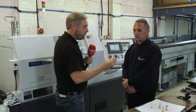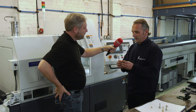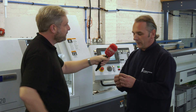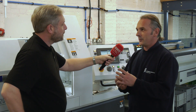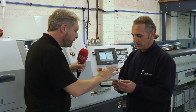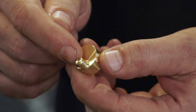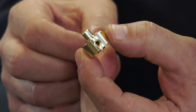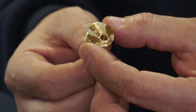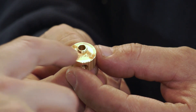The first example part is a double eccentric with an offset hole and an offset spigot. The spigot holds a five-micron limit, which the machine is consistently achieving. Previously this part required three operations on a fixed-head CMZ machine; now it comes off the Citizen finished in one operation. Cycle times have been halved, or better, on some jobs.